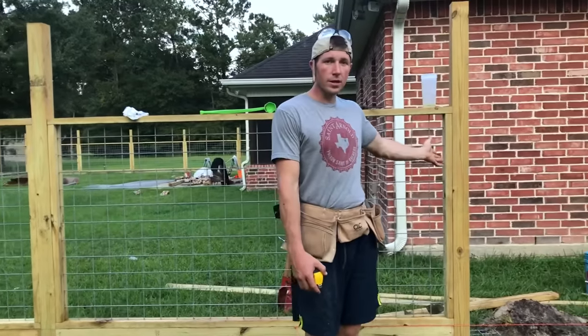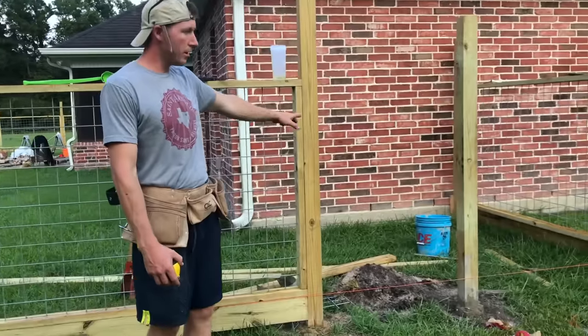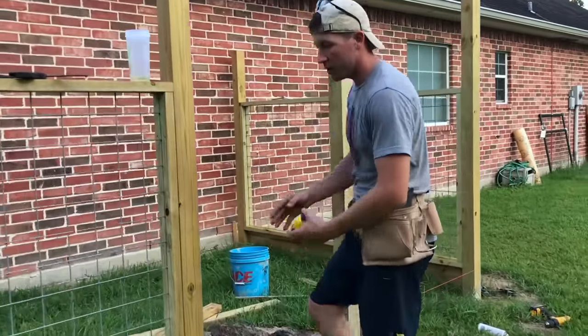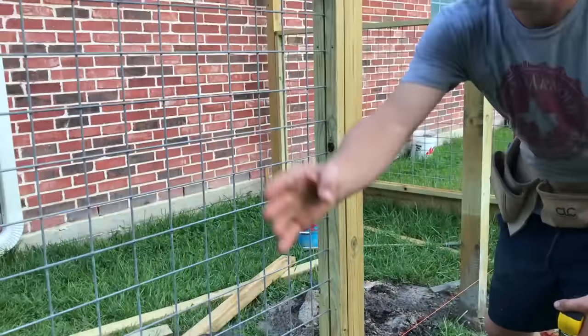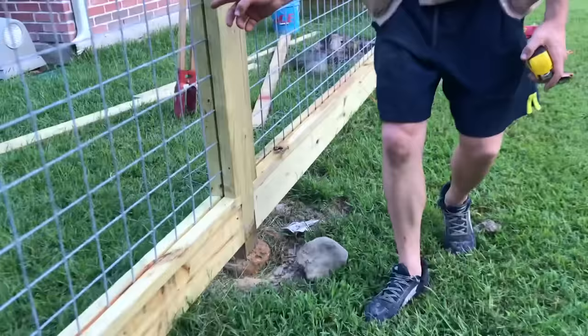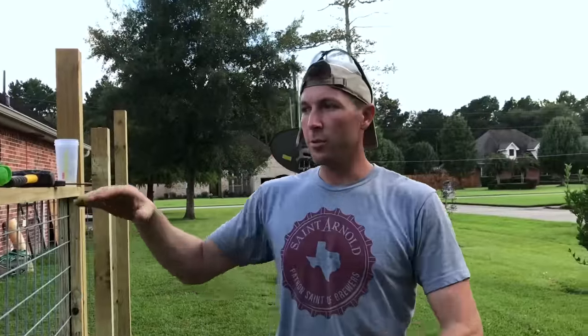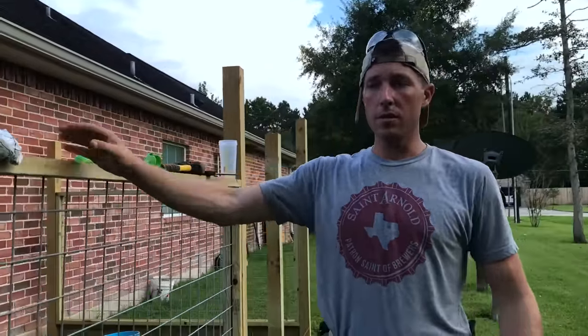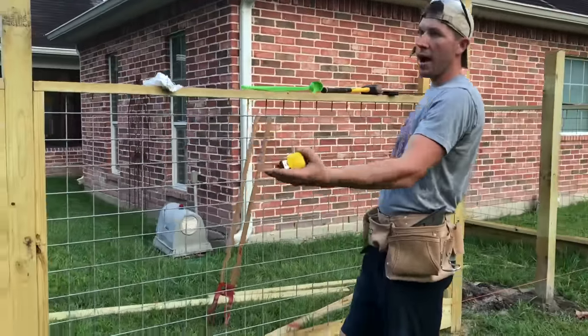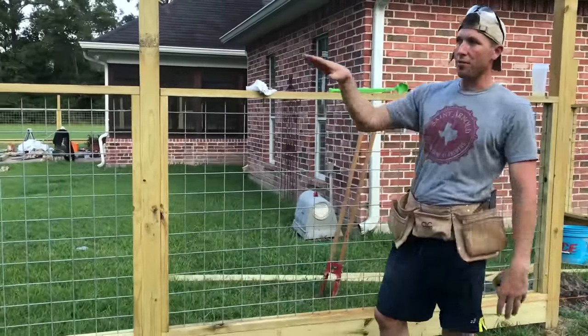I'm down to the last panel that I'm putting in, and I'm putting in a 4 foot gate here. So basically, as you can see here, all the way down, got the seamless setup of the dado running all the way through. As far as it going in, it locks into place. The great part about it is they're modular. You can do it at any dimension you want to. I ended up going with 8 foot center, so I didn't have to worry about sag.